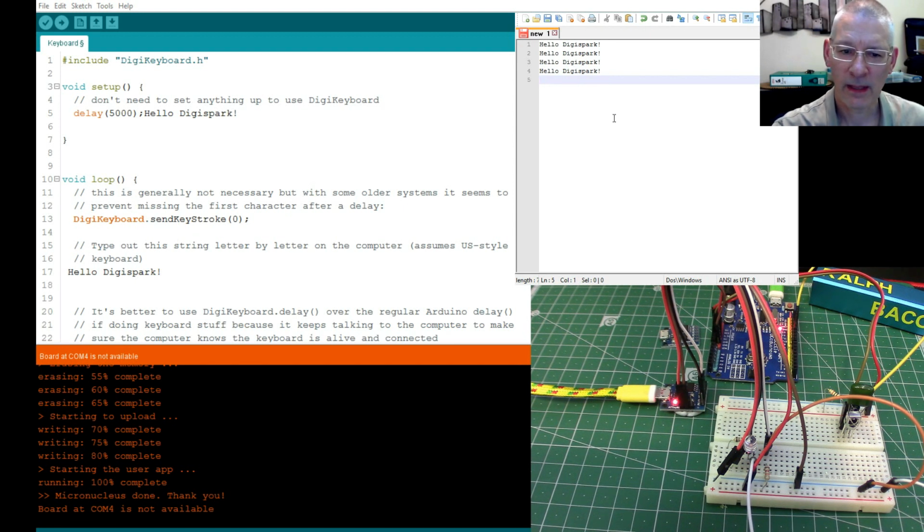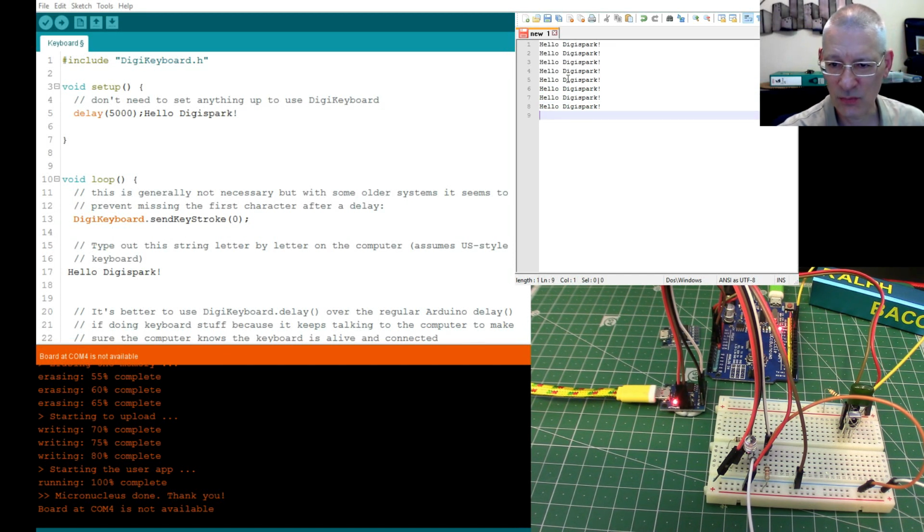Now, what I haven't discovered yet, but hopefully I will do, is how to send extended window codes. That means pressing the Alt, Control and Shift keys, which obviously can be done because that's how my little video controller works. Because it's all very well sending messages like this, but this probably isn't normally how you do it. Certainly my video controller, the one I just showed you, sends a combination of something like Control, Alt and then a letter. So it's something unlikely to be used elsewhere. And I use that as a shortcut.